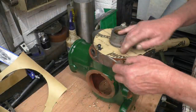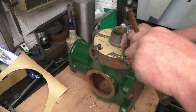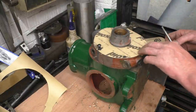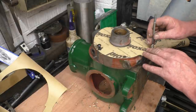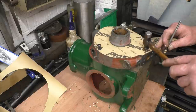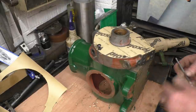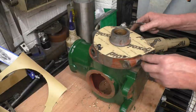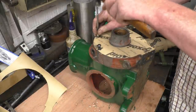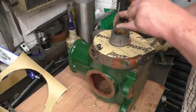Work all the way around — there's one there. I'm happy that the joint's in the right place; it can't be anywhere else really because it's a good fit on that register there. Really neat, really tidy. There's a special one here — the shape of the oil port, like an oval. It's quite important we get this one right. Take your time and it makes a nice job of it — you can feel the ball drop into the hole. Obviously you've got to make sure you get the bits of joint material out of any holes.